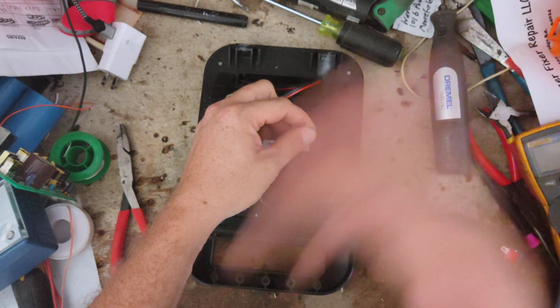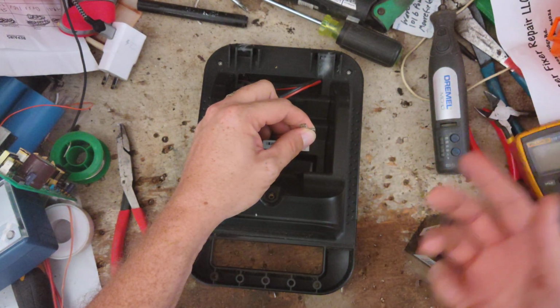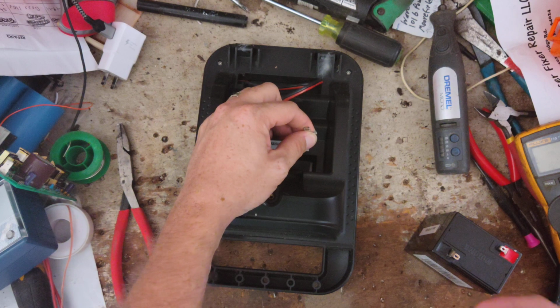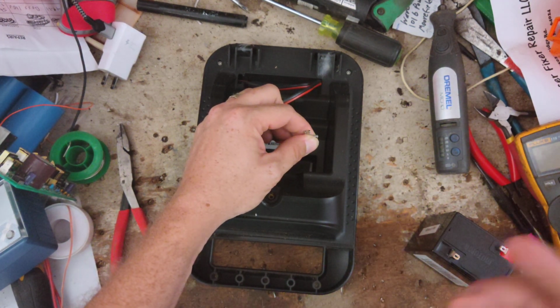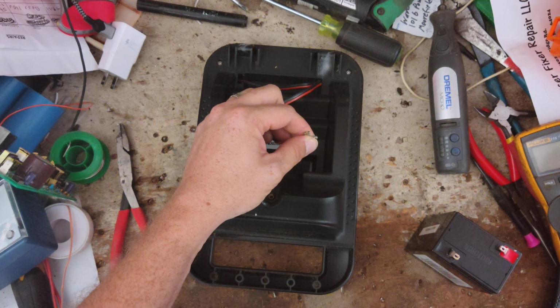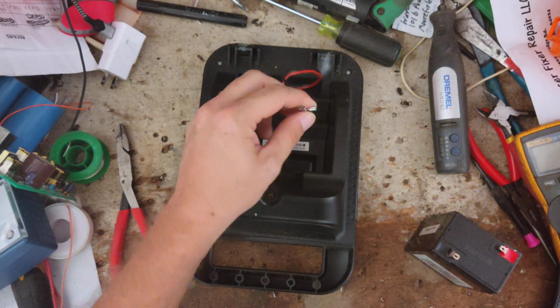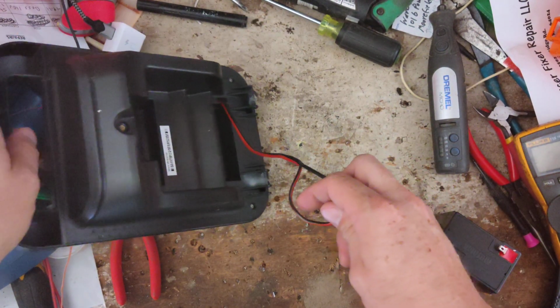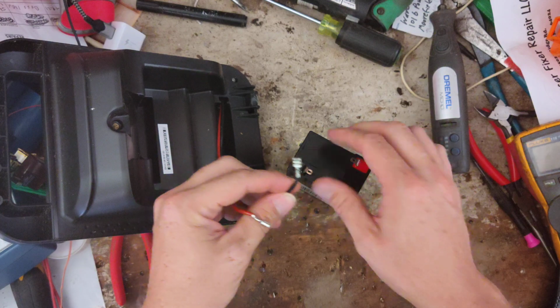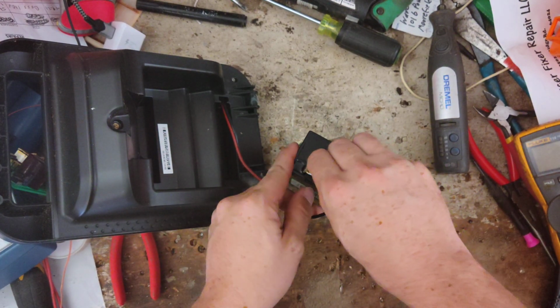It's kind of a neat little trick that you can do with these newer Gallaghers. The S17 and S20s, you can't do it with those, but S10s, S16, S20s, and S40s maybe, and S100s, you probably can do it with those too. It's worth a shot to try. It's a cheap thing to try. So hold it together for about 30 seconds or so, and then you'll hook your battery back up if the battery's good. If the battery's not good, resetting it and hooking back to your battery is not going to do anything.